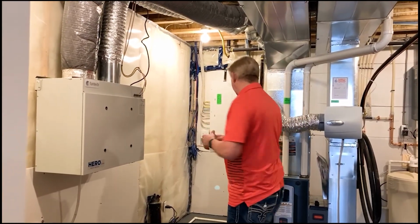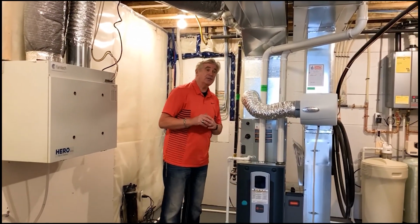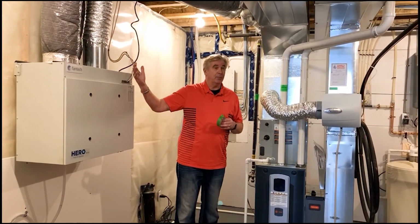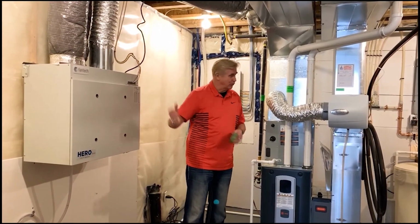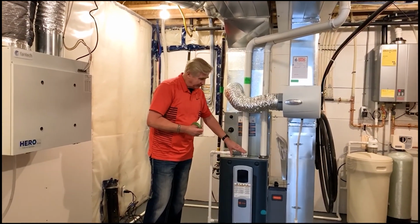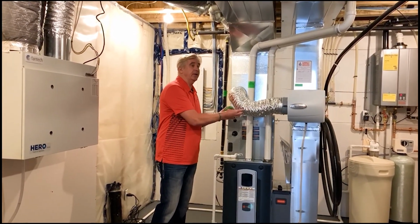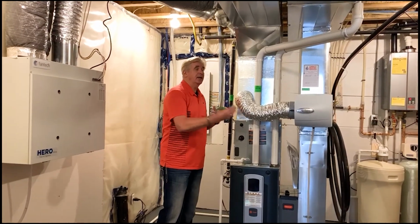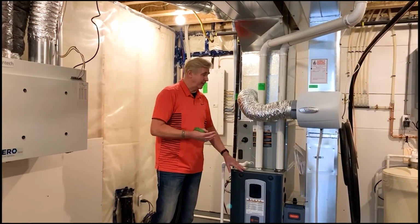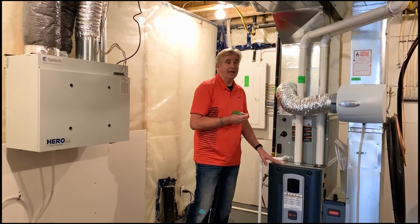And it'll blend that and come back into the furnace, so it has to get reheated up to go back into the house. So the efficiency factor is we're taking air that's from the outside, which 7 months a year is going to be a negative number, and we're trying to build that into the house. We're taking the effort and ease off the heating system so that we're warming up the air that's probably blended with an interior plus 20 to a minus 20. It's down to maybe 3 degrees, 5 degrees as it blends and mixes back through, and it only has to heat up that much to get it to the 24 or 26 degrees that you're putting back into the house.